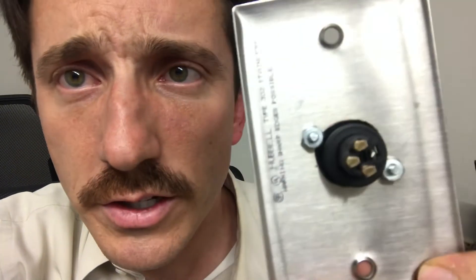Don't use plastic to mount your panel mount XLR connectors — they'll break within a month. Online you'll find pre-made metal panel mount plates for five dollars, but if you get blank steel plates at Home Depot you can spend only a dollar or two. You can drill them out yourself with a 24mm drill bit and a few small holes for the screws. Hopefully these tips and tricks on XLR and microphone cables help you out.